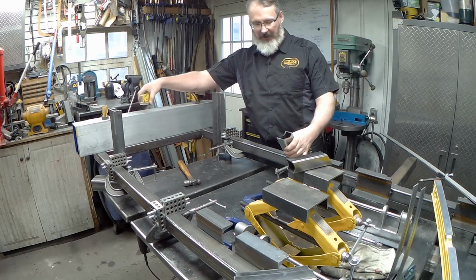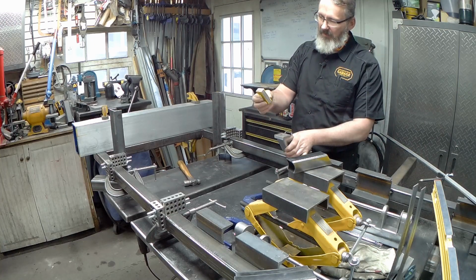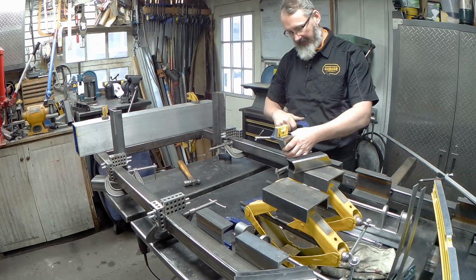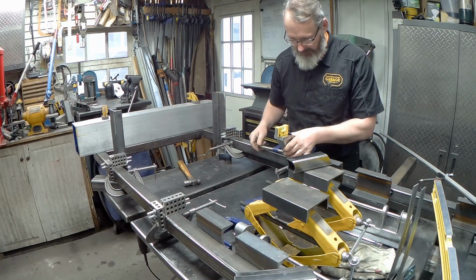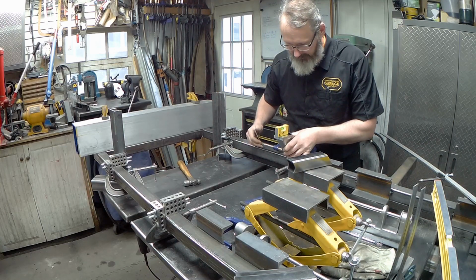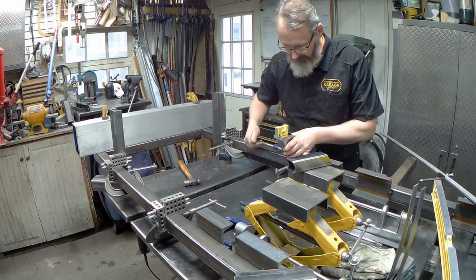Now, to make sure I'm doing this correctly, just using my small and reasonably accurate level here, setting those in. This all becomes kind of tricky to do. So I got to watch to make sure it's perfectly level. And then I clamp it. It always moves just a hair. Okay, so we then clamp that in.